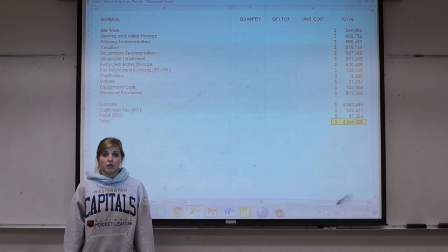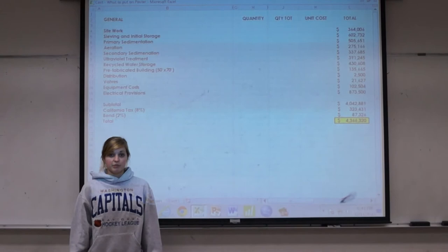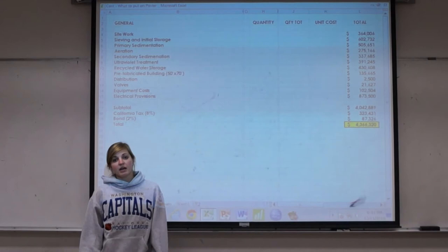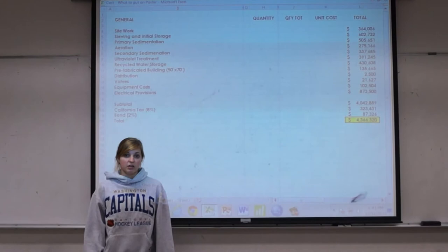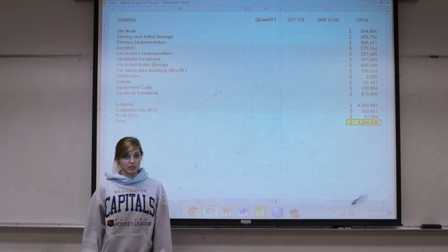Now that we know what we're building and have an idea of the project, we need to determine the schedule, the duration, and how much it's going to cost. Our project involves demolishing an existing maintenance building. We will be on site starting January 6, 2014 to move onto the site. We will start by demolishing the existing building, then doing a grade of the site, followed by excavating the tanks and pouring the tanks. All of the tanks are going to be cast-in-place concrete, and we will need to install the pumps and do all the electrical. The total duration for the project is roughly 8 months, and it is set to end on August 15, 2014.